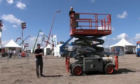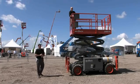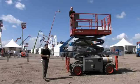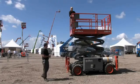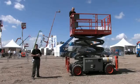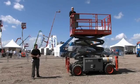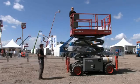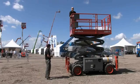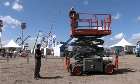You could actually just unbolt the top of the cylinder and just rest it down, of course using your maintenance safety bar to properly support the scissor assembly. But this allows you to repack the cylinder without actually pulling it out of the machine. If you need to pull it out, it's also easy to do that too. So no sledgehammers, don't need to drive the pins out. So again, serviceability, saving time during those moments when you actually do need to do some service to the machines.